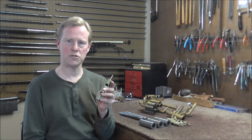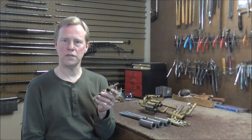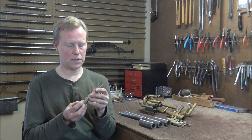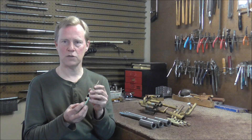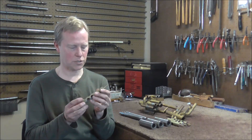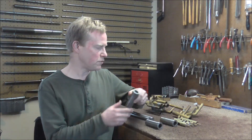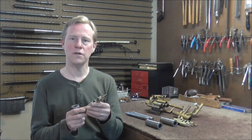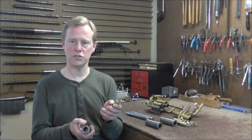Right now, these valves are not very cylindrical — they wore down very unevenly over the years. So I'm going to build that copper plating up, and then I'm going to wear it down, and then I'm going to build it up again with some nickel plating, and I might do another layer. I'm not sure yet; we'll have to see how things turn out. Copper is a very soft metal and it wears down very easily. I'm going to lap the valves in with one of these casing sleeve mandrills and wear down the copper plating on the high spots, leaving the low spots, making the valve more cylindrical so it will conform to the casing sleeve.